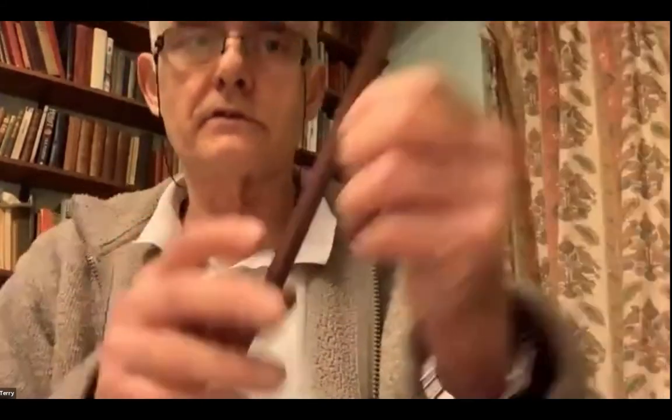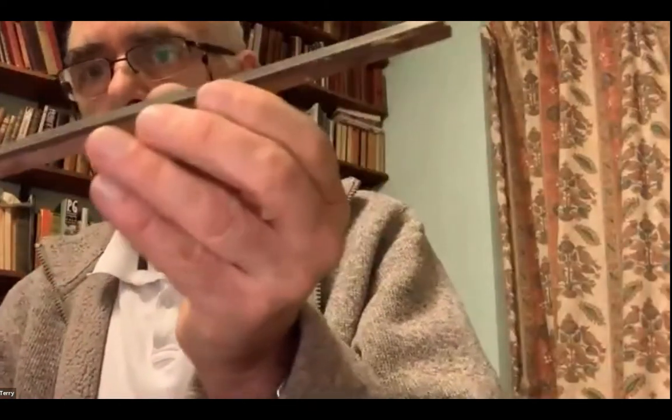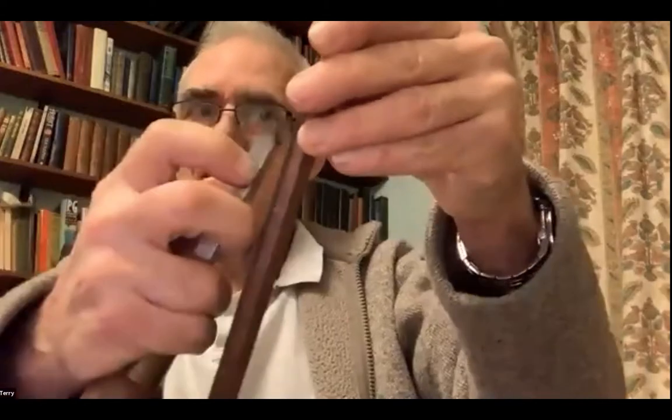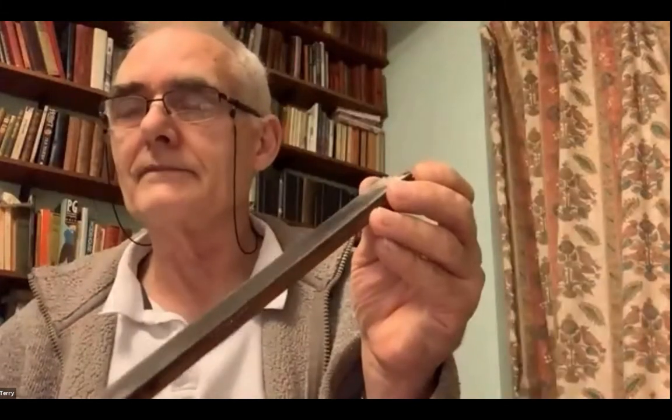And finally, there's the strop. I use a bit of leather belt glued onto a piece of wood, and you put compound on that, and either on the bench or I hang it on a wheel, on the wall, and you take the tool to it. And put the bevel on and draw it down. Draw it down like that, same the other side. It takes off any burr that the grinding has given you. Again, gives you a beautiful sharp edge. Will round over the edge. Everything does that except the grinder itself. But it's something you can try. And you can do that with a flat piece of MDF. Put the compound on the flat piece of MDF and strop away.